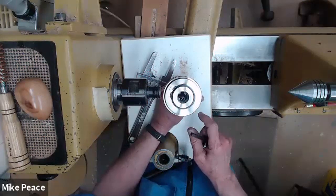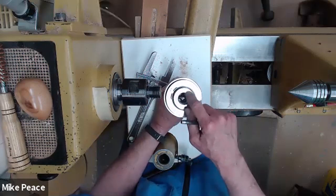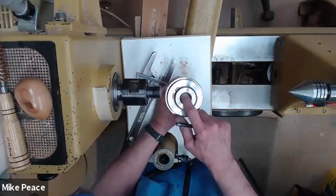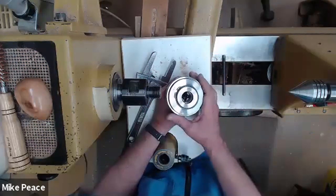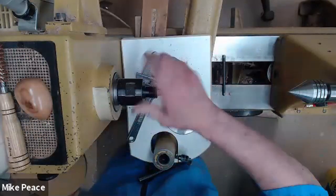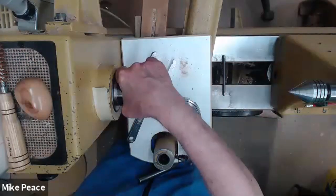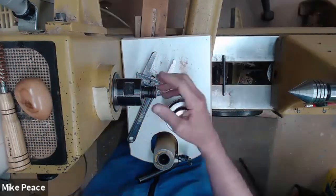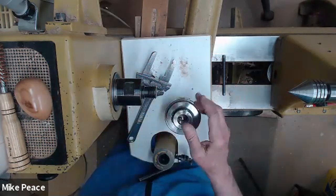Plus, they save about $20 in the manufacturing process in that you don't have to buy a separate $20 to $25 adapter to fit your chuck. Now, the downside is it is whatever you bought. And if you want to use it on another one, for example, this is a 1-inch, you can buy a spindle adapter. Now, the problem with a spindle adapter: anytime you add extra fitting, you increase the chance of some run out, a little bit of wobble. Normally, if you buy quality stuff, it's going to be minimal, but there is a risk.